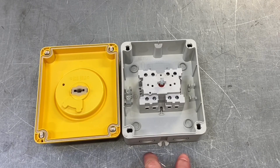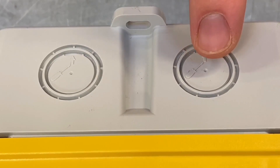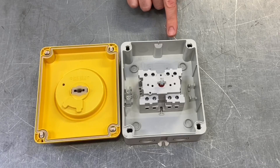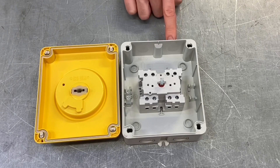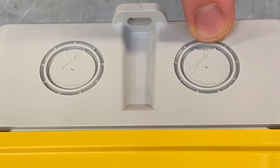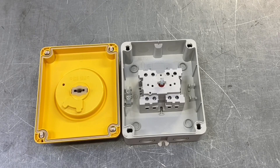There are two entry holes in the bottom of the electrical enclosure for the wiring system, and two options at the top as well — plenty of options for bringing cables in. Speaking of nice touches, even the knockout has had thought given to it: there's a small nib in the middle where you can place the arbor for your hole saw or pilot drill to guide a neat 20 or 25mm hole. There's also a groove in the bottom of the knockout to get your screwdriver in and lever it out — no more struggling with side cutters and possibly hurting your hand.